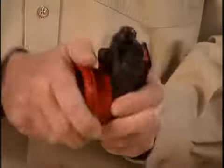While we are conducting our engineering and marketing research into the random orbital sanders available today, and the likes and the dislikes that exist within the models available in the marketplace, we found a growing concern about the disassembly and reassembly of the air motor that's inside the housing. I'd like to take a few moments to show you how simple it is to extract and reassemble the air motor in our new sander. The starting point is to remove the locking ring. Once you have removed the locking ring, it is then simply a question of extracting the motor.